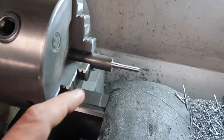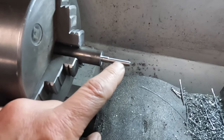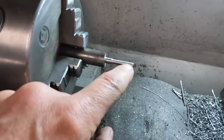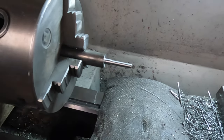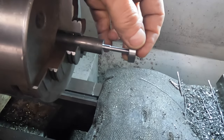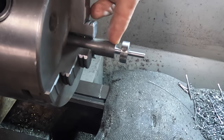I have decided to use a piece of mild steel instead of a hardened bolt because I realized afterwards that this is going to require some very small holes in it and I am just going to break off a bunch of drill bits. So I have got it turned down — this diameter is just a little bit smaller than M6 — and that is going to allow me to slide this on and thread this section to M6.